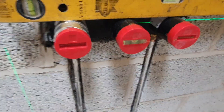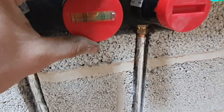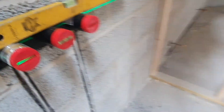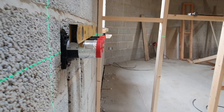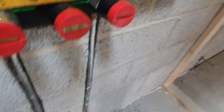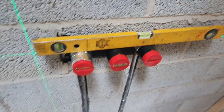I've got the basin tap all levelled up now. It's a little bit of a job to tell because somebody will come in and say it's not level, but that plastic moves - so I've levelled it on my spirit level and had the laser on it as well. By my calculations that should be bang on. Just need to make sure it's plumb coming out the wall as well - you don't want it on the lean. I've got my pipes dropped down through the floor. I just need to put some nail plates on these, sort the waste, and then have a tidy up.